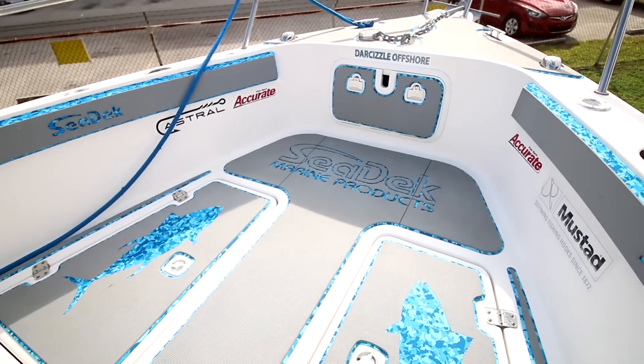Whatever the US Coast Guard requires for your size boat, you need that — check it out with the lights and all that stuff. If you're going offshore, you need an EPIRB or personal locator beacon — it's a necessity. On this boat we have an EPIRB, and we always carry a PLB — a personal locator beacon. Press the button, it sends a signal to the satellite, the satellite goes to the Coast Guard, and they come pick you up. In Florida we only go a couple miles offshore typically, so we have all this stuff covered.